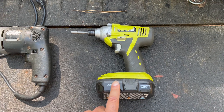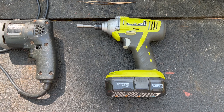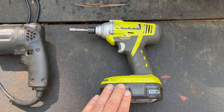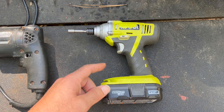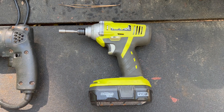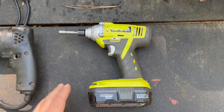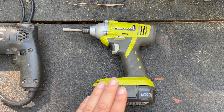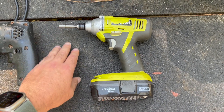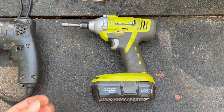What I've moved to nowadays is a cordless impact driver. Normally you'd use an impact driver for high-torque situations like deck screws or framing screws, but with roofing screws there's not a lot of resistance — I'm not using it for high torque or impact. The benefit is the control you get: as the screw draws down and starts to snug up, the gun automatically slows down and increases torque, giving you a ramp of control that eases you off just when you need it most, so you don't overdrive the screw.